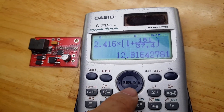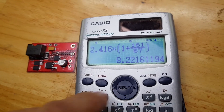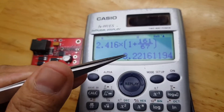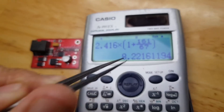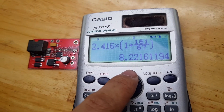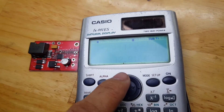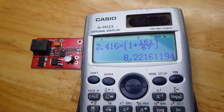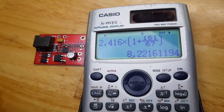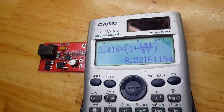But since we're using a 2S or 2-series configuration, this is my new calculation. We need to change the resistance to 67 kΩ to achieve an output of 8.22V. The original 37.4 kΩ resistor is being replaced. 8.22V should be enough to charge our lithium-ion battery — not fully charged, but sufficient to charge the battery.